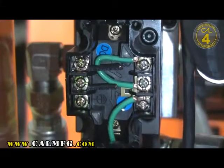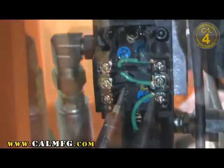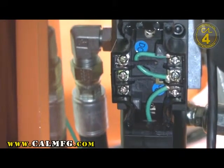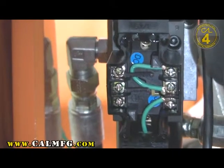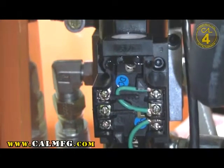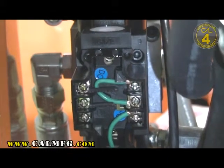That is the hot wires that will be coming from our handle to power the valve — coil A and coil B. We mark those. It doesn't matter whether you wire A or B; the only difference is which button is going to be working up and which button is going to be working down. If that's an issue and you have it installed and want to swap them, you would simply come back in here and swap those two points.